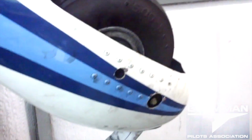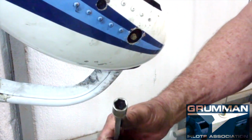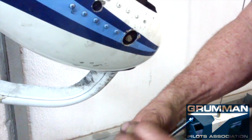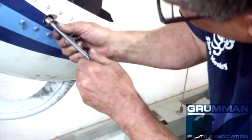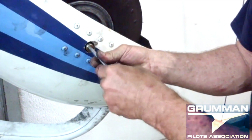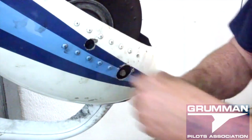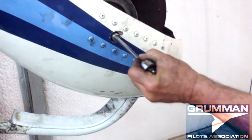And now we'll just put the bolt on and tighten it. So to put the nut on, we actually have a 1/2-inch socket that we've shoved a paper towel in, so that when we put the nut in, it sits right at the very end, so we can just reach in there, feel the axle, twist it and get it started. And then it's a matter of now getting the other sockets and putting it to final torque value.